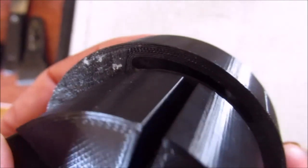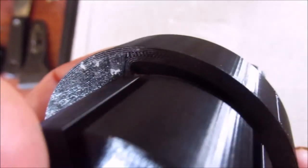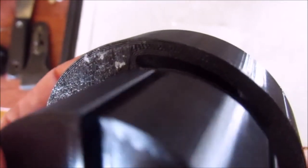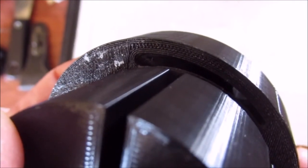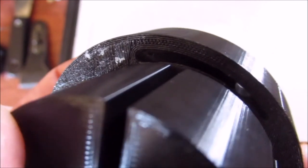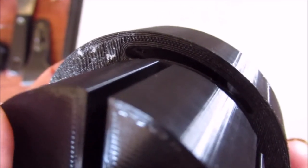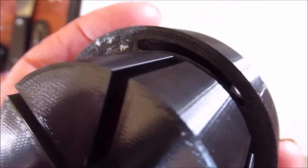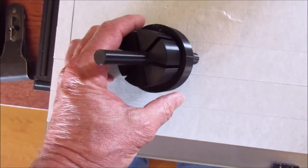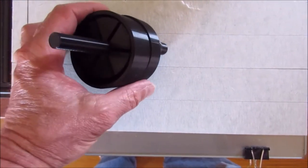You know, if there's any kind of imbalance, you're probably going to create cavitation or cause high power consumption and excess force on the motor, or the motor will have to work twice as hard, right? So that's going to cost you in electricity.